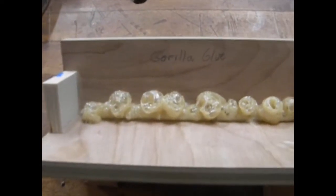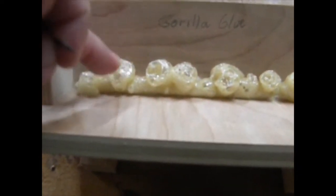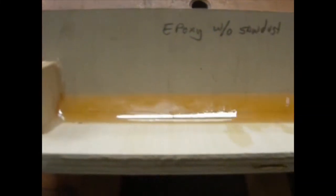It's been a week and I've allowed all these glues to set. The gorilla glue has interesting little bubbles that were fragile last week but have gotten harder. The center part where there's no bubble is pretty firm. The Titebond without sawdust doesn't show up on camera too well. The Titebond with sawdust is pretty hard and has sunk in at the center. On the side where I added extra glue, it's not completely set, but the other side is even harder. The epoxy without sawdust is hard as a rock, and the epoxy with sawdust is also hard as a rock.